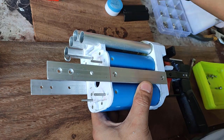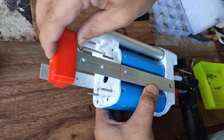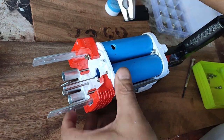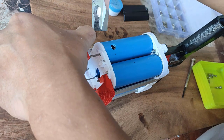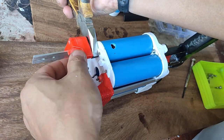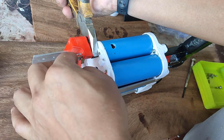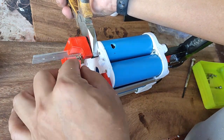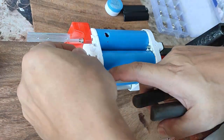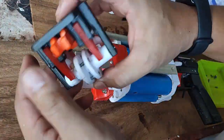I've already attached the side rail. These are the priming devices — you just insert them like that and screw it a little. I take my wrench or pliers, partially pull it out, clamp it down with the pliers, and tighten the lock nut. Once that's in it should never come out. You have to do this on all four plunger rods.